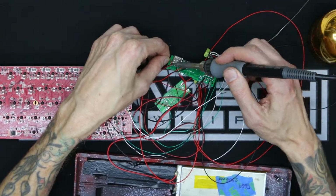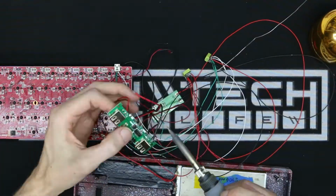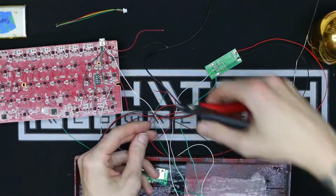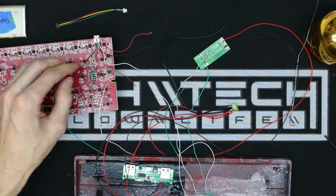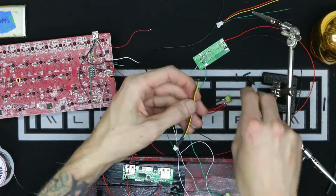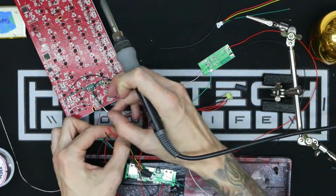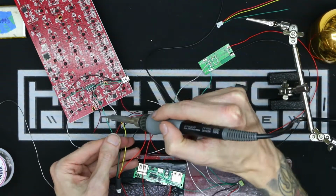Now, the not so fun part of dismantling everything that you just made in the efforts to make all the wiring a lot cleaner. This is also a necessity because there are so many wires that it would be hard to stuff inside of the case without running into further problems. I almost always wire things this way, where I'll do one pass where all the wires are really long and messy, and then only after I have verified that the circuit works correctly will I start trimming down wires and making things a lot cleaner.